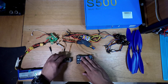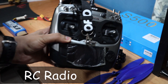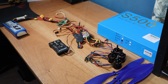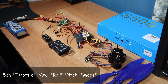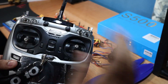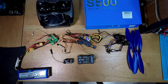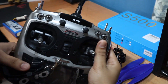All that's left is to tell the drone where to go — this is where the radio receiver and transmitter come in. By controlling the stick movements you can control the drone through the flight controller. For the Pixhawk it's recommended to have at least a 5-channel radio for throttle, yaw, roll, pitch, and flight modes. You would need a receiver that supports PPM or S-Bus communication; a PWM receiver would require a converter. I have a 9-channel RadioLink AT9 with the R9D receiver, which supports PWM and S-Bus. My Pixhawk bundle came with a PWM converter, and there's also a newer version, the AT9S, which I'll link in the description.